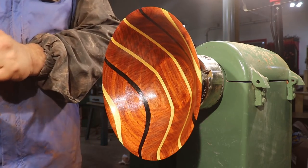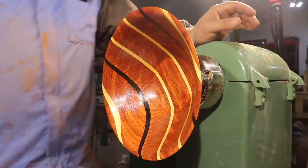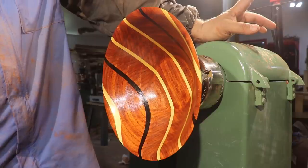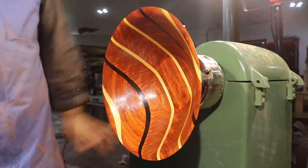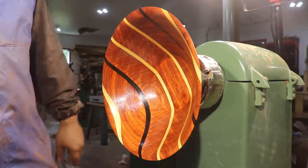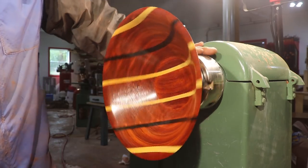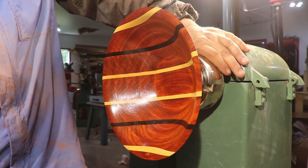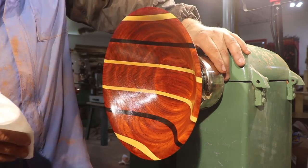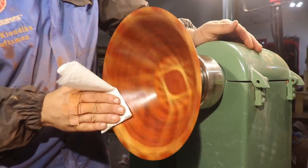So a couple things I'd do differently. Another thing too is I use a really thin kerf. I just got it, it's a Carter & Sons 16th inch parting tool, from Branches to Bowls in Calgary, and I'm really happy with it. I'd be leery about doing that with a very thick kerf parting tool. The way that one is designed with the hook at the bottom, it didn't leave much in there to get wedged. So I would caution people who try this. Everything you do is at your own risk, and I don't like to cop out like that, but you could wedge that in there and wind up launching a piece of wood or breaking your chisel or whatever. So I would caution you on that part of it.